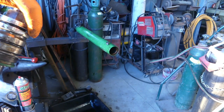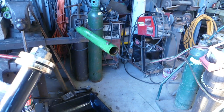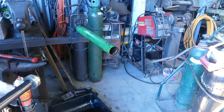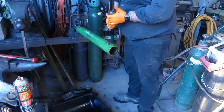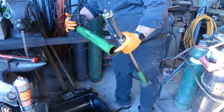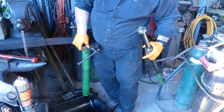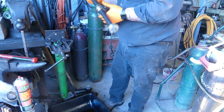So it looks like it was two-piece with that reseal. So we're gonna reseal the whole cylinder. We're gonna pull this nut off, pull the head gland off, and go from there. So let's get after it. Nice part about this vise is it's on a pipe that goes on the side of the bench. So I can actually just turn it down, let everything drain out. With a short cylinder like this, it's perfect.